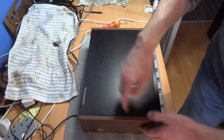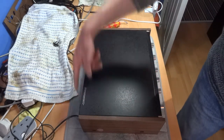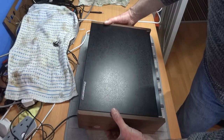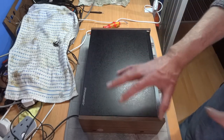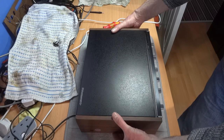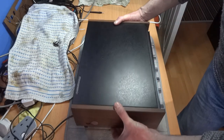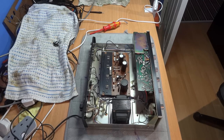I've already taken the screws out — just four screws on this particular amplifier, two on each side. Some amplifiers or receivers may have two or three more screws at the back on the back plate. You just lift the lid off. With this particular amplifier there's just a little trick to it — it doesn't pull straight off, it slides backwards, the lip comes away, and then you can put it aside.